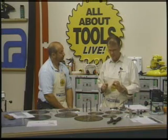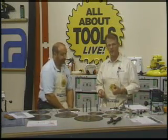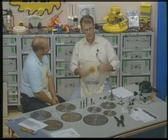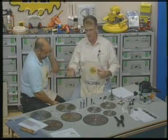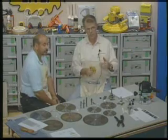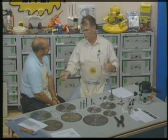The other thing that I was really fascinated to learn, and this applies to saw blades too, everybody wants to know how many feet you're going to get as far as cut before the bit is dull. Right, what can you expect? Exactly. It's not about how many feet you can get as far as cut. What's more critical is the quality of cut you get. So if you were to break it up into A, B, C, D, and D finally being either throw it out or get it sharpened, and A being that it is just at its prime condition, what you're really looking for is as much A cut, a good amount of B, and then at C you want it to go out to sharpen, because if you run it to D point, you might as well throw it out.